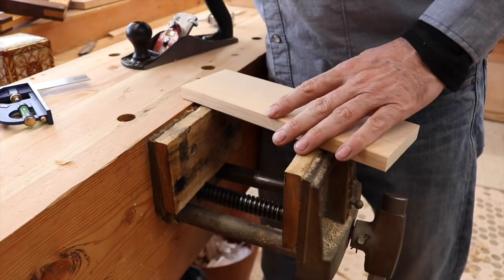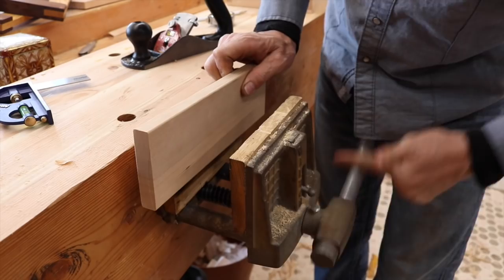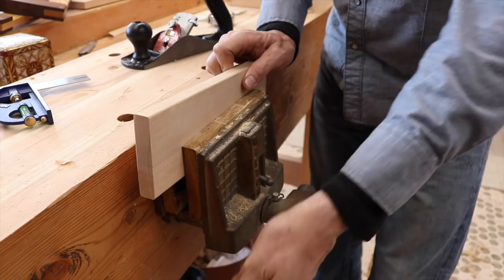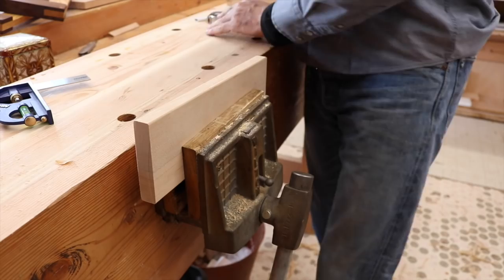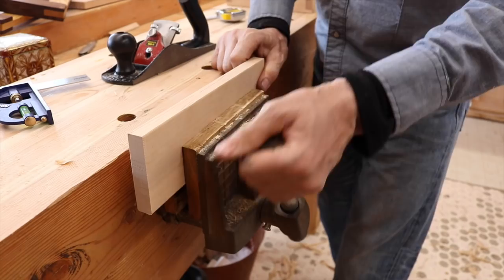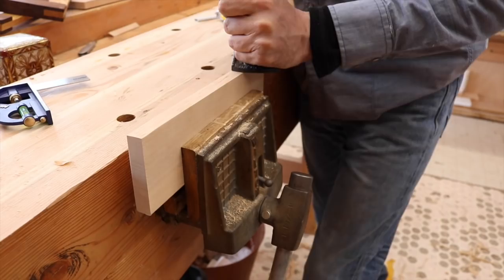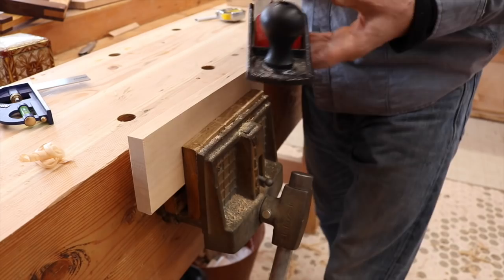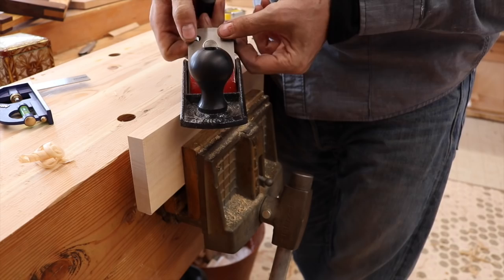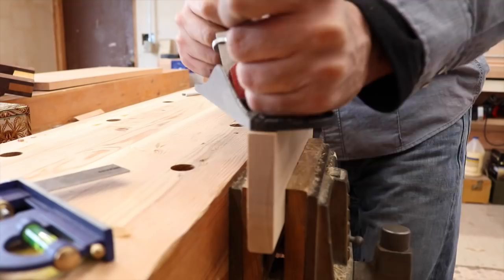Here's a scrap piece of CVG fir we have left over. The block needs to be about one and a half inches by three or so, but we've got the quarter round on there and we want sharp, clean edges — I don't like the look of that quarter round. So we'll take our Stanley SB4 plane, the best $20 plane money can buy that I've found, and square that off. That's the plane working good — what a nice square edge. Let's back that off a little; it was cutting a bit deep. I found this plane to be pretty easy to adjust.